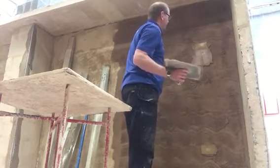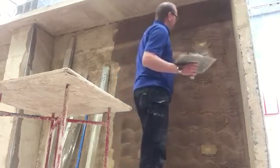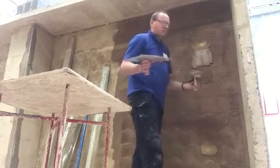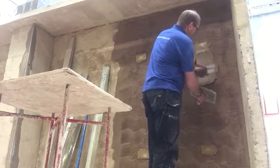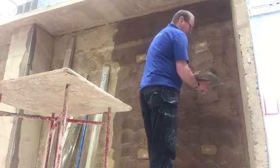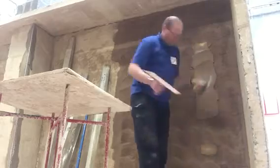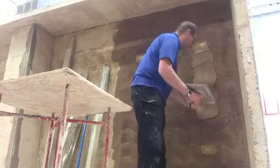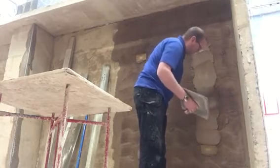Obviously, because then it will be loose, but just try and glide the trowel with your render on just over the dot. What you're going to try and do is not take the trowel so far, because you're putting on approximately about 10mm, which is the thickness of your render coat. So just don't take it too far. Alright, so then the render is not too thin. Okay? So you're working your way down to the bottom dot. Alright, so just make sure you've got enough on.